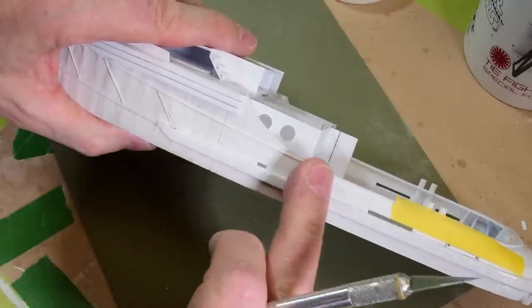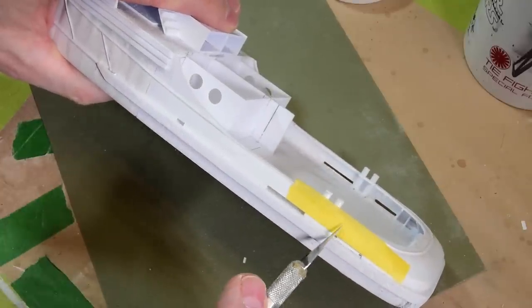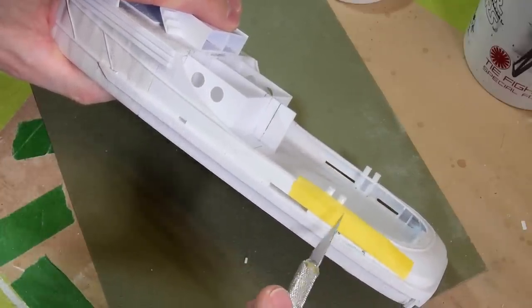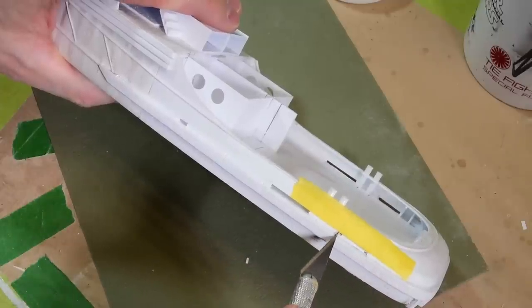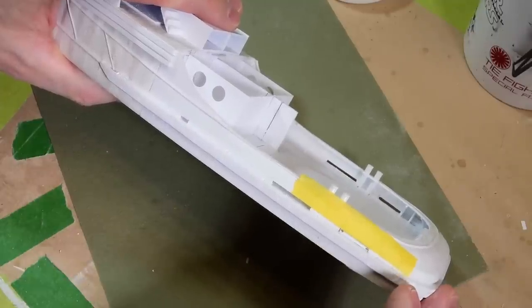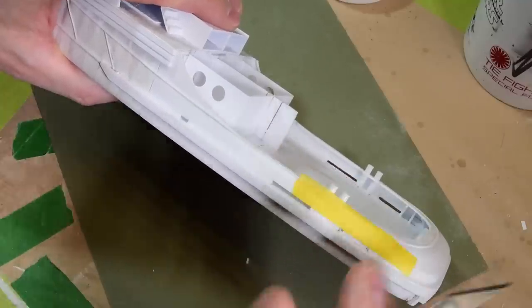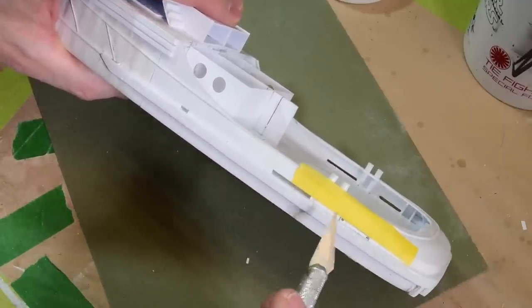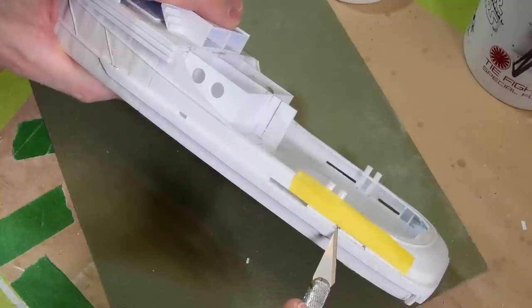But then this fairing's fairly straight too. But the problem is here, there's a scupper in here, but this fairing curves, it compounds. It curves in and rolls over. And if you try to cut that in ahead of time, you're never gonna get it straight. It's gonna pull away, it's gonna deflect, right? So it's best to just build the whole piece in and then come in and just draft it on with a pencil.